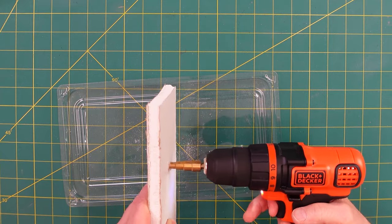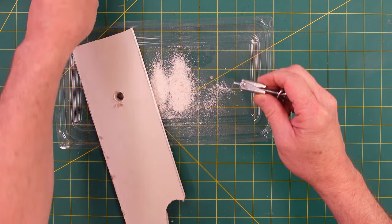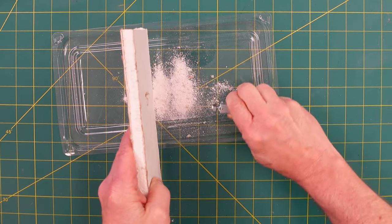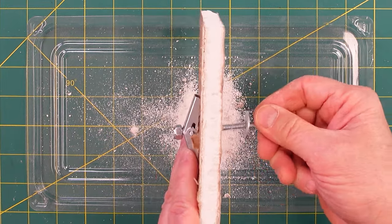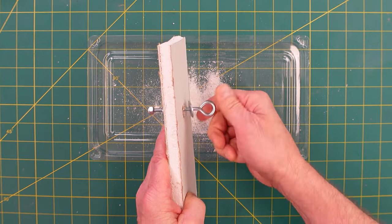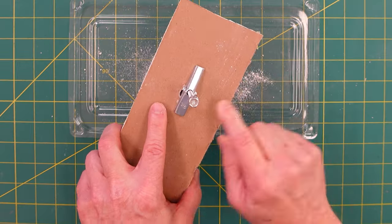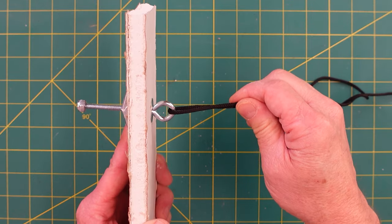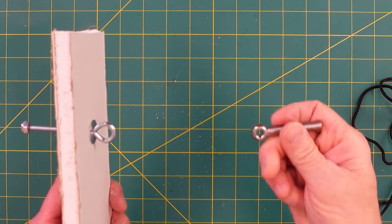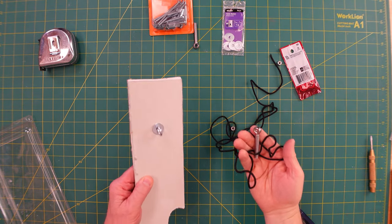You're going to take the step drill and just expand that hole out. This is why you need the half inch hole — because of the toggle bolt wings. I'm going to put a nylon lock nut on there, which is totally optional. This is what it's going to look like when you go through the hole — push it through, try to pull back, and just tighten that up. Then the three-quarter inch washer seals up the hole so you won't see it anymore. You'd have to literally try to rip the television out of the wall for this to even start to bend.